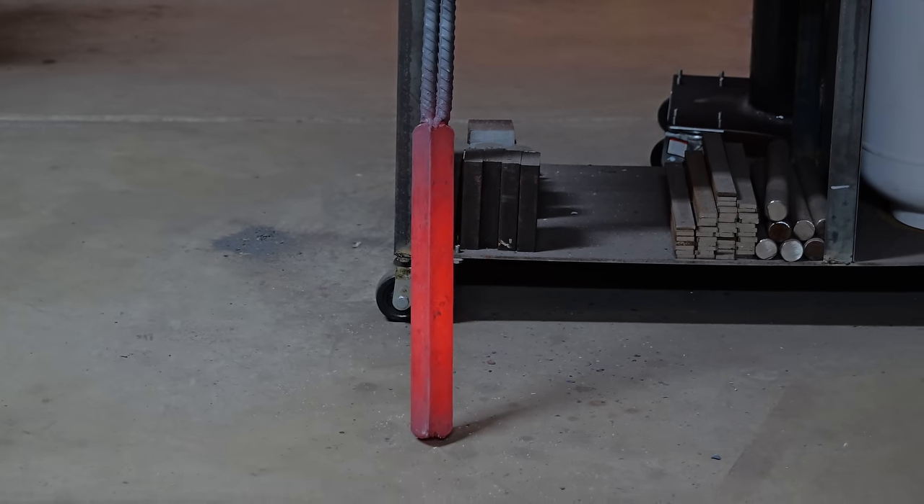To make the integral bolsters on this blade, I'm using a technique I learned from Salem Straub in Washington — forge welded bolsters. This is a tile of the same mosaic I made the blade out of, and I'm grinding it into a nice rectangle that I can cut into two and forge weld onto the blade. One of the defining features of a Chinese cleaver is just how wide it is — the billet was only two and a half inches wide at this point, so I had to creatively give it an entire extra inch of width. I made a mistake drawing out the entire blade at once, which messed up two of the tile welds, so I fluxed it up, took it to a hand hammer, and re-closed those forge welds. It was a recurring theme — those two forge welds at the edge were really finicky.